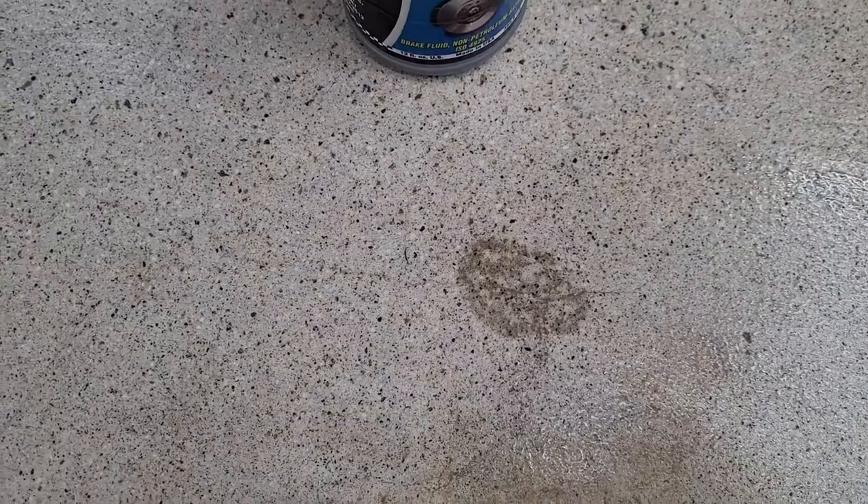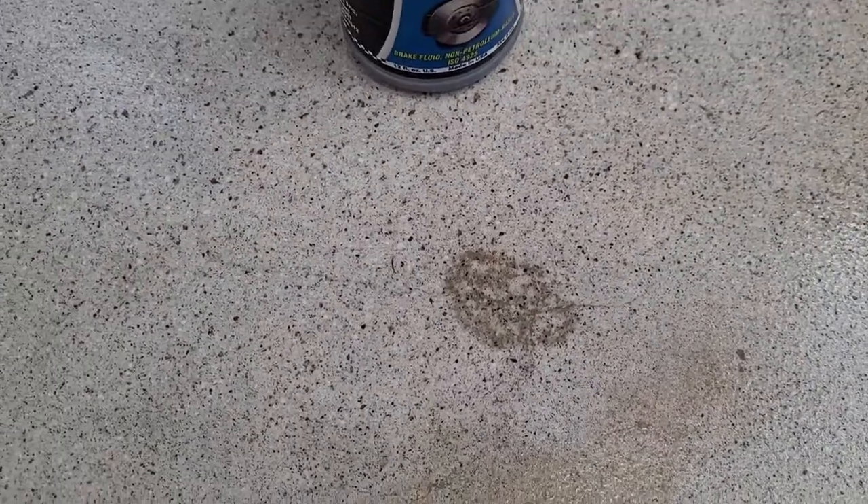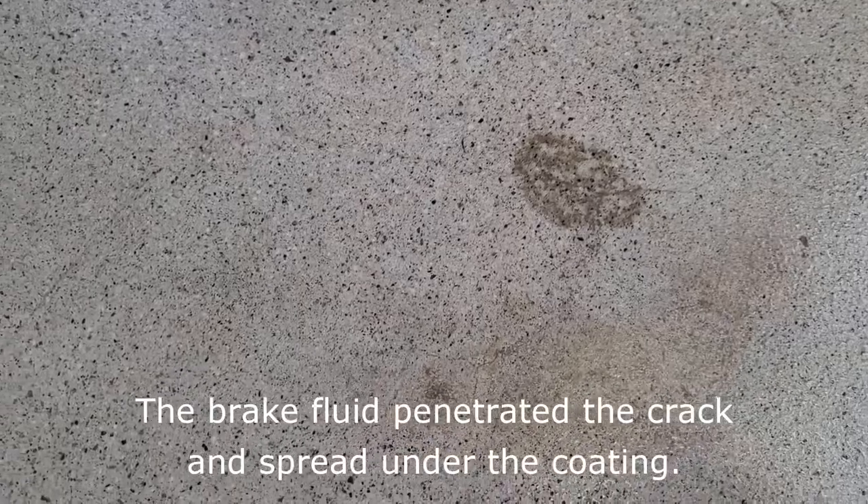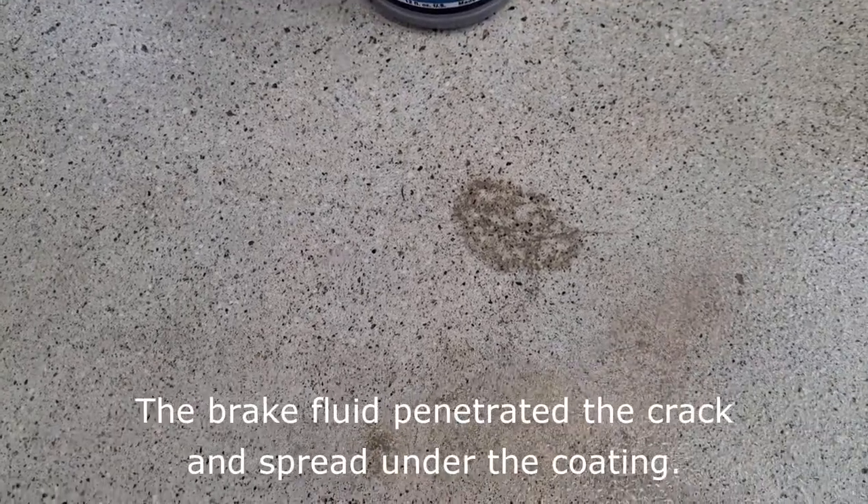The only mark that we have — and this is incredible — is the brake fluid. But if we look really close, there's a crack that runs through here, and this is really bad concrete. The initial application of the water-based acrylic sealer probably did not fill that crack very well, and water-based sealers like that don't. If we'd put another application on there it might have made a difference, but it's one reason we never put a coating on this particular floor. I don't believe that is a failure of Ballistics — instead, the brake fluid was able to get into the crack, because Ballistics is not going to seal over cracks like that or bridge gaps. That's why we have that stain right there.